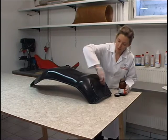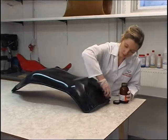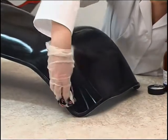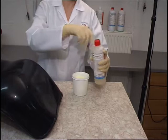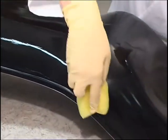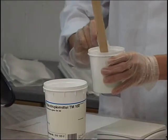The new mold is waxed four times with the priming wax. The mold's edges must be waxed thoroughly to avoid adherence of the finished component. The release wax needs to be left for several hours until it no longer contains any trapped air. Before manufacturing, the film releasing agent is applied once again with the sponge. Depending on its thickness, the film releasing agent may take up to 30 minutes to dry.